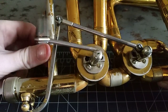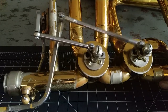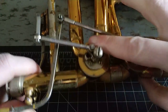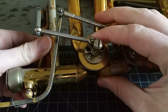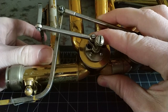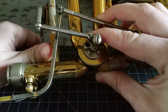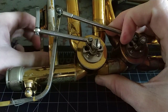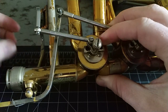The first thing you're ever going to notice is slop in a valve — like if you press something and instead of moving the valve, something else moves first. It's not something you can always see right away. The way I check this is by holding the stop arm — that's the arm that stops against the bumpers. Hold that down so it's against the open bumper, and then move the lever. We've got a whole bunch of slop there. You can see that's moving a good quarter of an inch before anything happens. All of this gets taken up and then the valve moves.